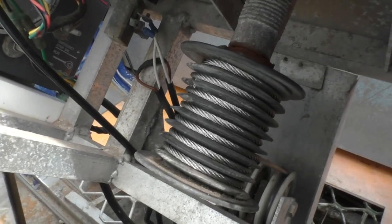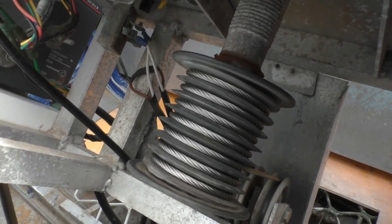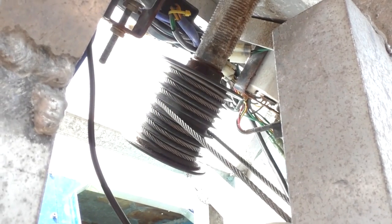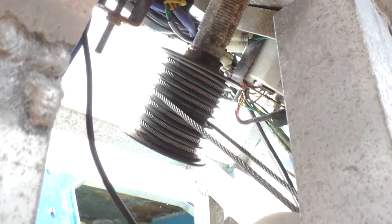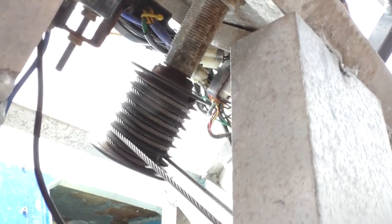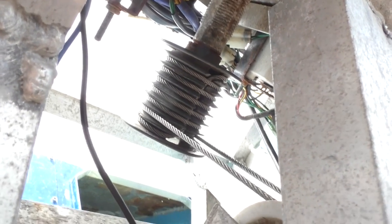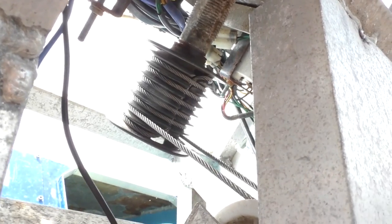To give you a better idea of how these systems work, I'll put the camera underneath so you can see the two ends and I'll show you as it turns from port to starboard. You can see here both cables are meeting at the centre of the drum, which is the midship position. Then as I start turning the helm to starboard, both cables are moving till they meet at the forward end of the drum. When that happens, most of the starboard cable has been wound out and most of the port side cable has been wound in, which is what pulls the motor over.